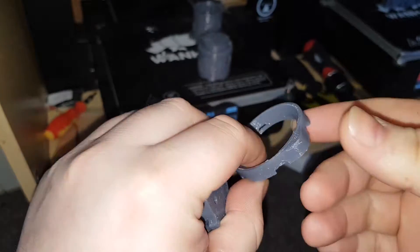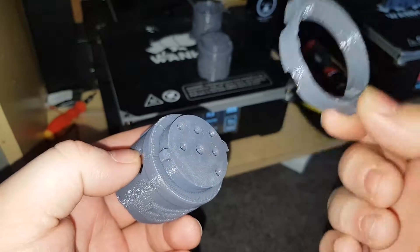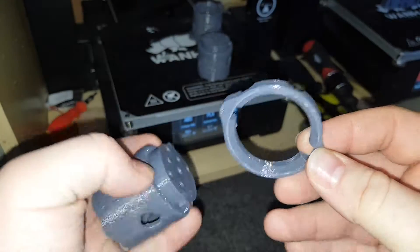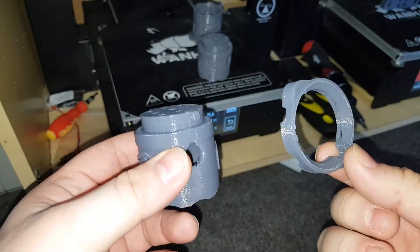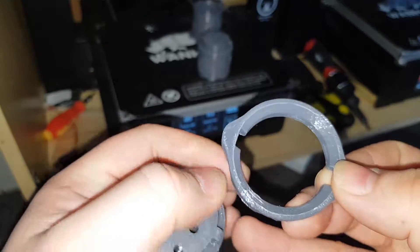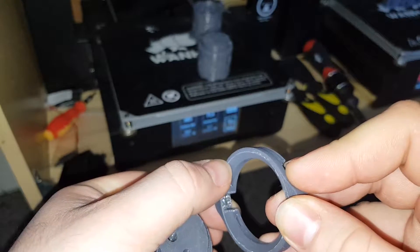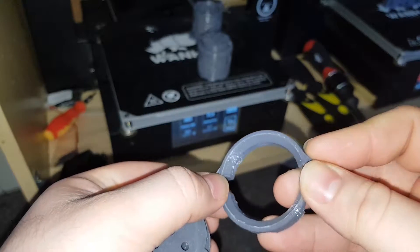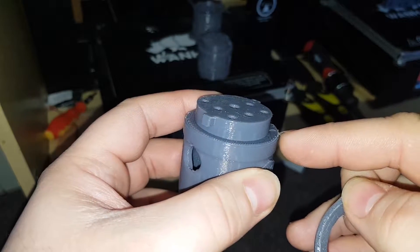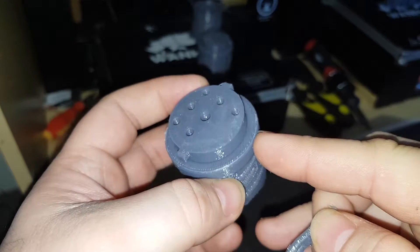So this is the sacrificial material. And this is not generated by the software you saw — that generated it for the wipe-out part that you can hear printing in the background. I actually designed this part to mate with this perfectly, so that I could produce many of these and pop these off really, really quickly. The gap where they touch is this white line here that goes around there. That's where the plastic has just separated. And you can see that these edges need cleaning up with a Stanley knife before that can be shipped to my customers.